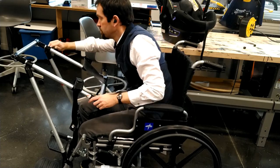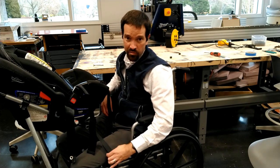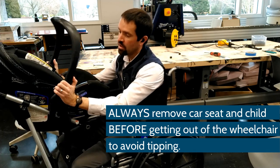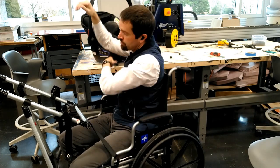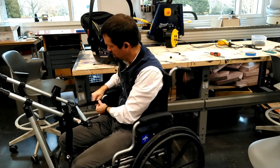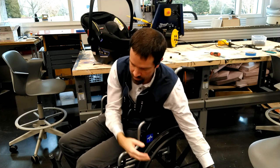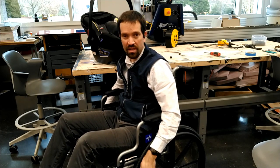Sitting in the wheelchair, you can easily remove the device by unbuckling the infant car seat. You could either remove the child and hand them off, or lift the whole car seat and set it aside securely. Undo the belt loops and set them out of the way. Now you have your wheelchair back the way it was originally. Practice that process and you're ready to go.